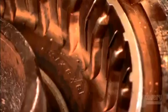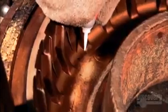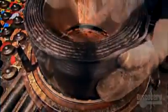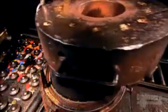These tires need some tread. They begin by spraying a release agent onto a mold so it will be easier to remove the tire later. Then they lightly glue the ID label and serial number plate to position them for transfer to the tire. They center the tire in the mold with a metal ring. Then they lower the top section of the mold onto it.